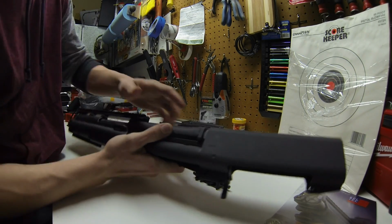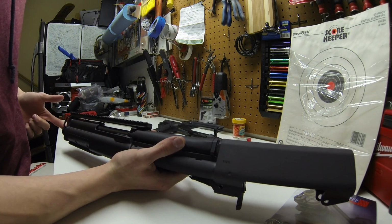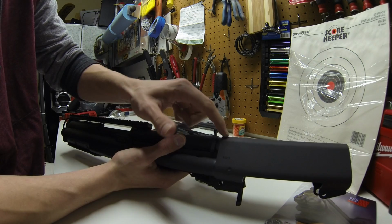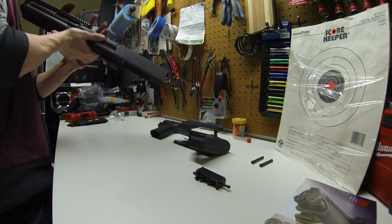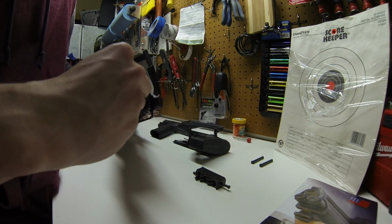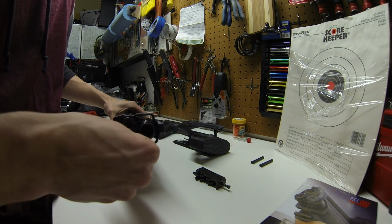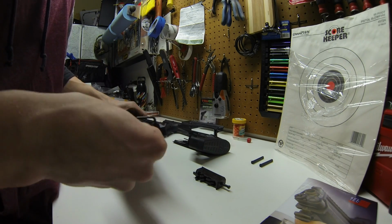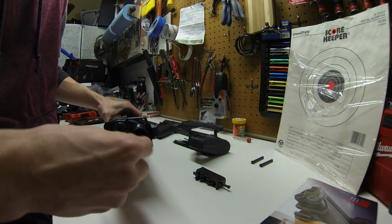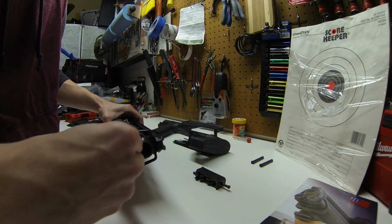And you're gonna notice this gap right here. This gap is gonna exist until our screws are all the way in. So we're gonna check that our screws are all the way in, because this piece should touch this piece when I'm done. So then we're coming back to our screws on this side. We're only gonna go about a turn or two aside before we switch. And they don't have to be ridiculously tight with a quarter. I like to just go about as tight as I can with my fingers. I usually call that good.